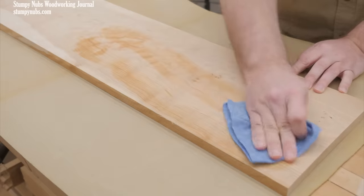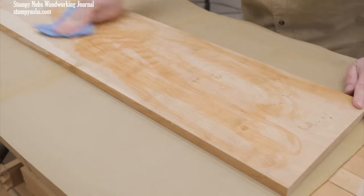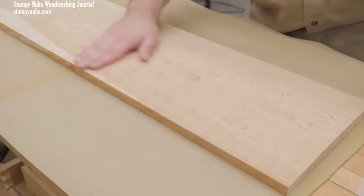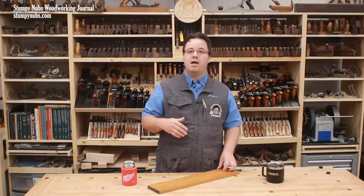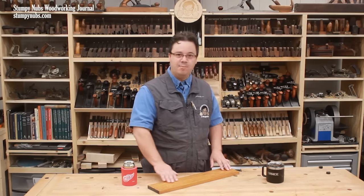The first factor will appear immediately after the first coat dries. The wood fibers have become swollen as they soaked up that first coat of finish, and what was once a smooth surface is already pretty rough to the touch. In our previous video we discussed a process for pre-raising the grain before you apply your first coat to lessen the swelling effect, but it still may have occurred to some extent, especially if you applied a water-based finish. So now you'll have to sand those fibers back down.